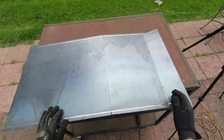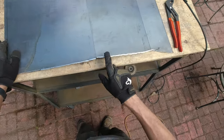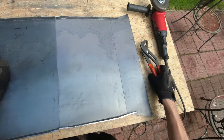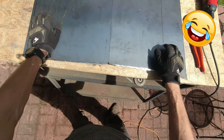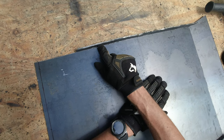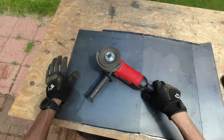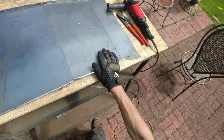This is slowly coming to what seems like a skid plate. I made the channel with a cutoff wheel and grinder, then I was bending it with big channel locks and a lot of heavy breathing. I didn't really record that part. As I'm bending the edges in, the gap is closing, so I'm gonna take the cutoff wheel again and enlarge it for more room to bend. Then I'll start welding. I measured it one more time on the truck — I actually cut a little bit off because it was too long, but it's coming along.